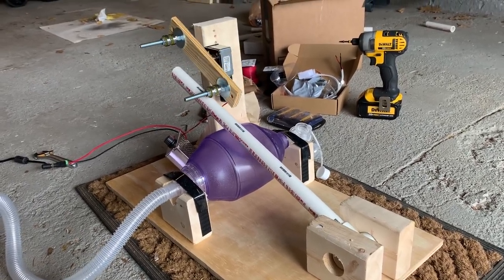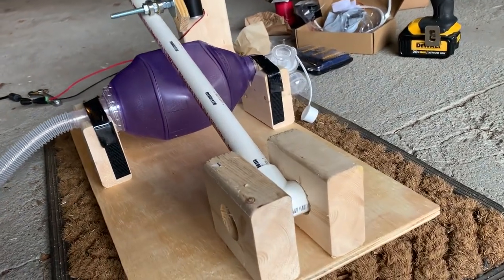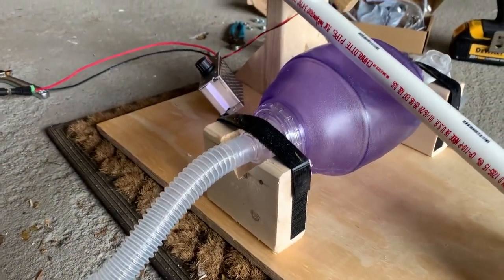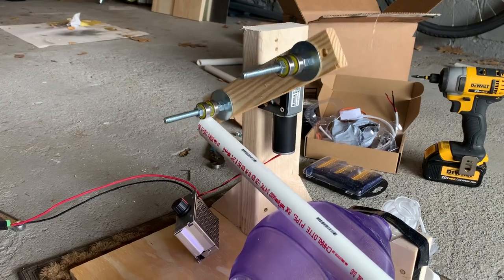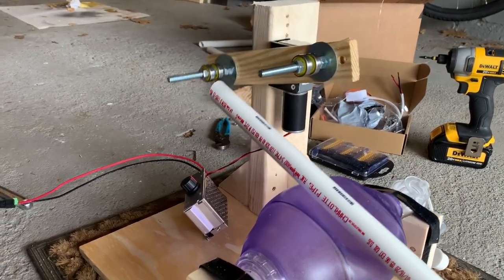Again, this is all very simple stuff, nothing too complicated. There's no real leverage down here — this is just pure PVC and a T-connector. The bag valve mask is just held in place with Velcro. And you can get a little look at the rotation mechanism and the pushing mechanism up there. Rate is controlled at the PWM module here.